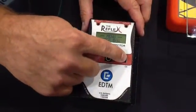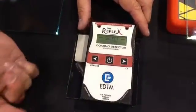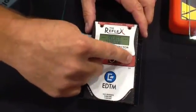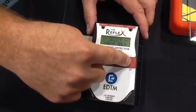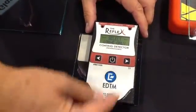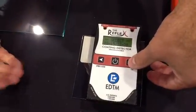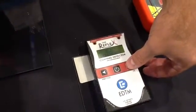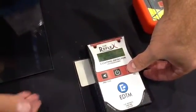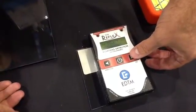Going into the menu system, you can quickly change modes: it can function as a self-clean coating detector, a tin side detector, or a low-E coating detector. It will also identify Guardian fourth surface IS-15 and IS-20 low-E's, Cardinals I-81 and I-89's, Guardian ShowerGuard, anti-reflective coatings, Guardian DiamondGuard coating, and back to self-clean coatings.